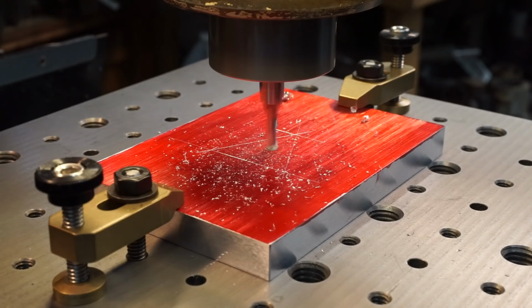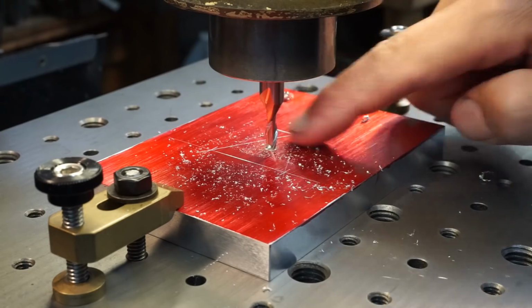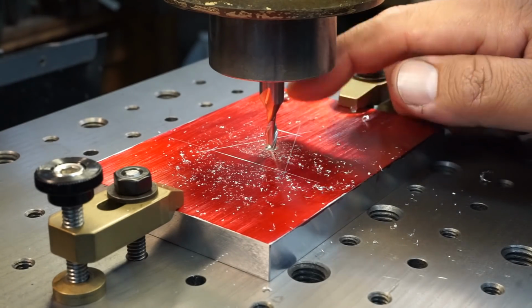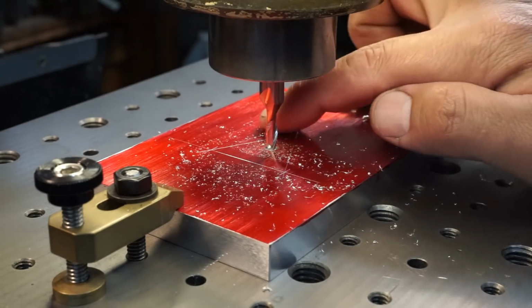Okay. And I've already got the readout zeroed out in our center, but I'll use incremental mode, and I'm just going to keep up with it. I'm going to have a 0 location on one side, and then I'll have another location down here that I know that I can go to every time and hit this end down there. And then we're going to be rotating the rotary table 27 degrees for each side of that.